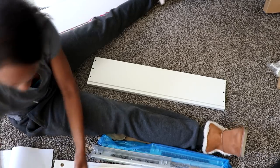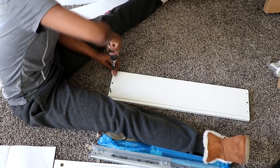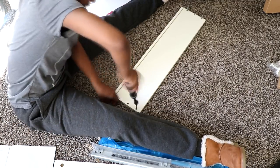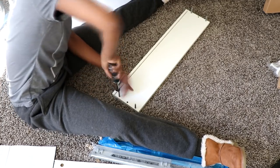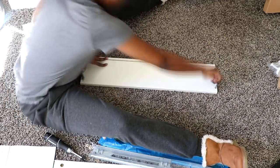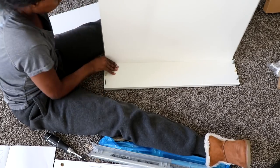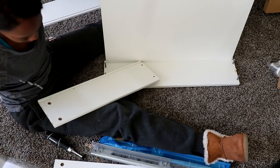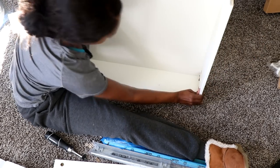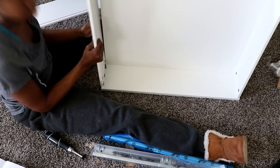But the pack system drawers are not hard at all. I mean, seriously, they really aren't. This is all a level 1 or 2. Like, you just put the 3-4 sides together, lock it in, and the way they built the rollers, you just screw the pullout onto the frame and then you just literally lay the drawer on top of it. You'll see me do it. But I will give them that. They made the drawers a lot simpler to put together than most drawers are.